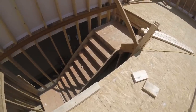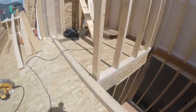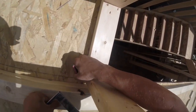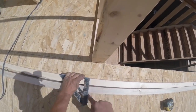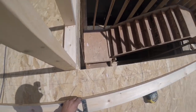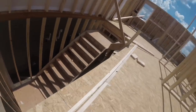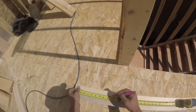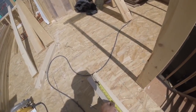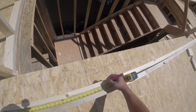This one out, do the same thing, mark this wall there, this wall here. Gonna have a 2'6" door right here coming right off the end. Mark my stud, cripple. The opening for a 2'6" door, my rough opening needs to be 2'8". You add 2 inches to the regular door.